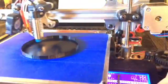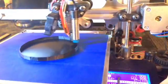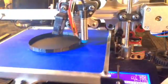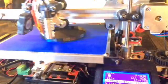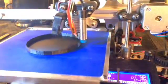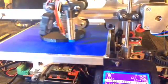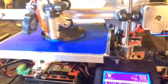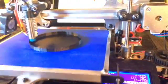So we're at 161 millimeters a second. That looks about like 175 — went a little over, there's 175. We're definitely getting some shaking, but as you notice the cantilever arm is definitely solid and in position. It's not wobbling up and down.